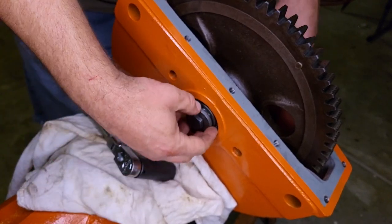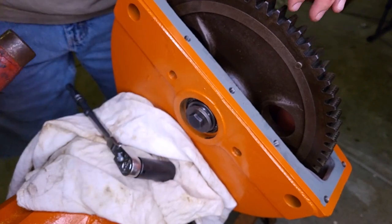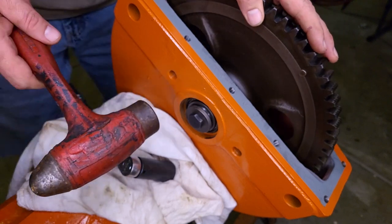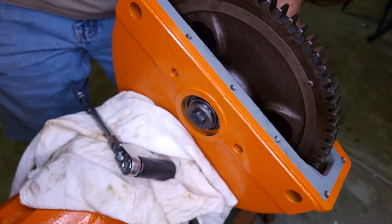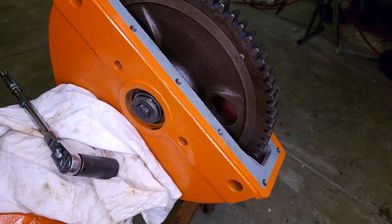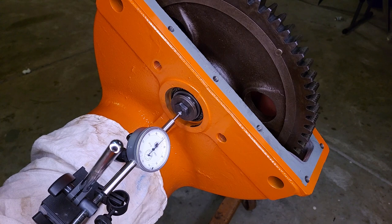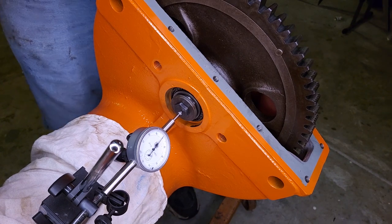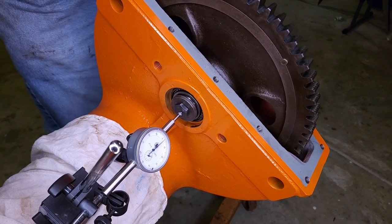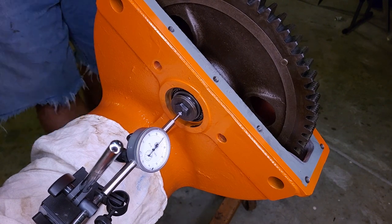First thing I want to do: right now that bearing is pressed all the way on so there is no slack. I want to tap it and loosen the bearing up a little bit to create slack, so when I tighten down against those washers I know whether it's taking away all the slack or not. I think I got a little bit of end play on it. I have not tightened this bolt yet. I want to make sure I have created enough end play on this shaft that I could tell if the shims do anything once I tighten it down. So I can pry back and forth - yes, there is some play there. We'll see if I can make that go away.